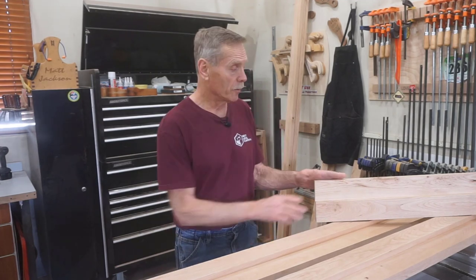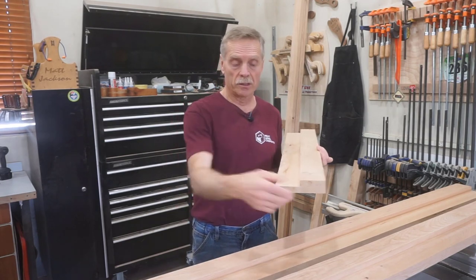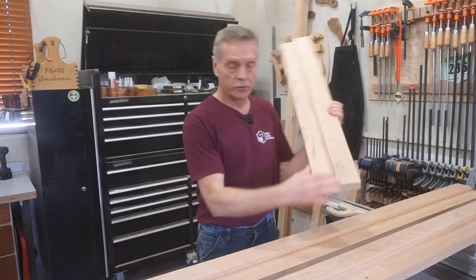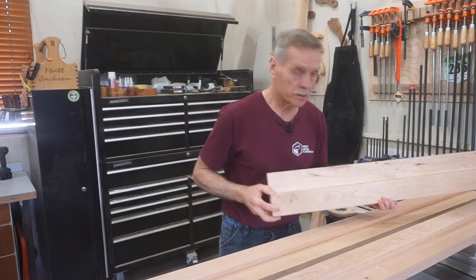It's somewhat less straightforward because I'm making an exterior style jamb with this step in it, rather than just a flat piece of wood like in a typical interior door jamb that has applied stops, rather than the integral stop that's milled right into this jamb itself.